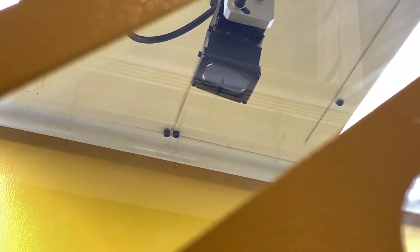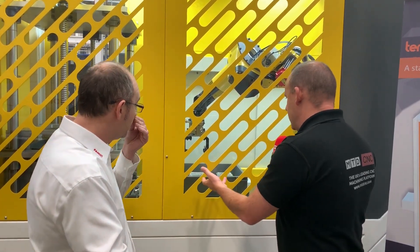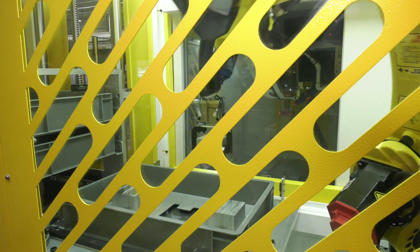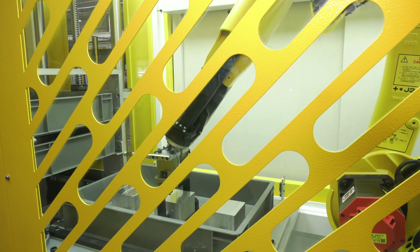There's a vision system there, so it's actually able to take a photograph and see where the parts are. Correct — we've got a vision system so we can pick up any fine deviations in position. It would pick up mistakes definitely, and we could configure it so an alarm triggers if there's been any misloading. Really we want to take as much work out of the machine tool as we can. If we had a probe in the machine it'd be taking up a tool position, but with the accuracy from the vision system it will load into the vice in a good enough orientation to machine the component.